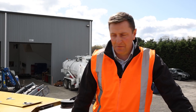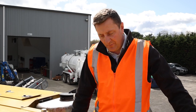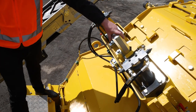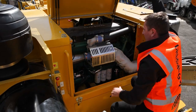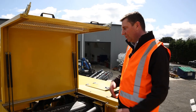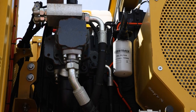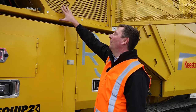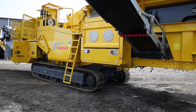We're standing up on the money side of the machine where the motor is. I want to point out here our closed side settings for our aprons — both the primary and secondary apron are hydraulically operated for the closed side settings. You can see these large cylinders here, which along with the torque side handle the closed side settings for primary and secondary aprons. Here within the engine compartment — really easy access. The Volvo engine in there hums along and makes this thing go. Really fuel efficient, which is a big part of keeping your cost per tonne down. On the drive side of the motor, a cool feature of the KeysTrack is the variable displacement pump, which spreads the load and is really fuel efficient. We also have the fluid coupling, which allows an amount of slip to reduce shock loading to the motor — with a direct drive through to the impactor.